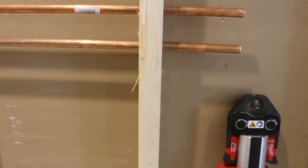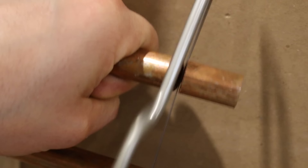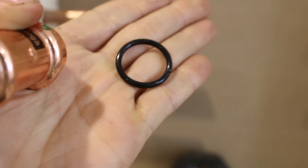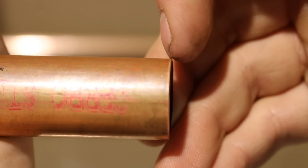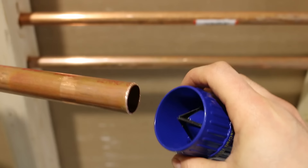Before starting, make sure to have a pair of safety glasses on because pieces could go flying and be dangerous. First off, you'll need to cut the pipe. I highly suggest using any of these types of cutters as they allow for a straight cut. If you cut with a handsaw, for example, it might get cut crooked and not seal properly. Whichever way you choose to cut the pipe, you'll need to prep it before installing the fittings as you don't want to tear the delicate O-ring inside. To ensure this, you'll need an inner-outer deburring tool. Deburring does two important things: it removes any sharp edge that might have formed on the outside during the cut, and removes the inner burr which prevents turbulence inside the pipe that could eventually cause leaks. So this step can't be skipped.